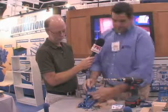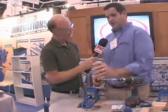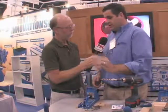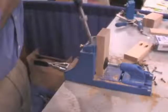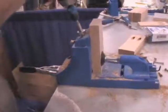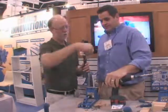So what we're doing here today is we have a 3/4-inch thick piece of material here. I'm just going to drill a pocket hole for you in it — show you how this works. Wow, you don't get too much easier than that. So you've drilled your flat-bottom pocket right there. That's all the machining you're going to do to this work piece. Wow, that was easy!